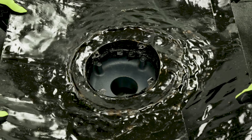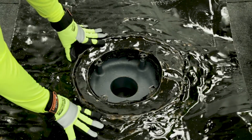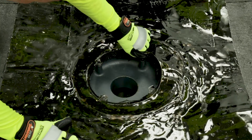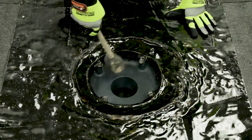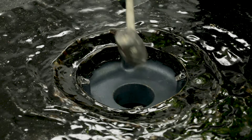Center over the drain and embed a 30-inch square minimum four-pound lead or 16-ounce copper flashing onto approved flashing cement such as PG500 or PP50. Extend the soft metal flashing into the drain bowl a minimum of two inches. Using the appropriate mallet, shape the flashing to form and extend the metal into the drain bowl.